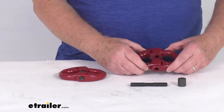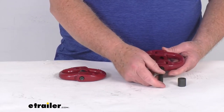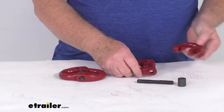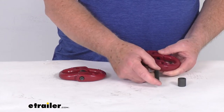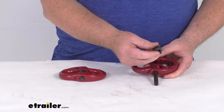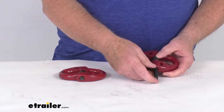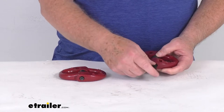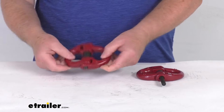When we talk about the hammer lock design, what that means is how they're put together. First you place the link into the opening you want, then put it together, take your pin and start that in, then you have your smaller diameter retaining collar that goes right in the middle. You push the pin in there and start tapping it with a hammer until it goes all the way through, and then you get your finished product just like this.